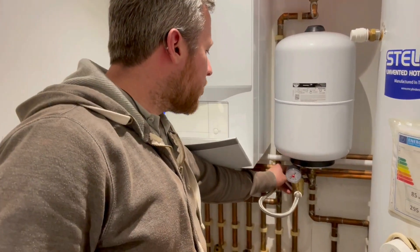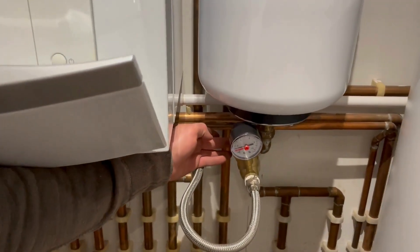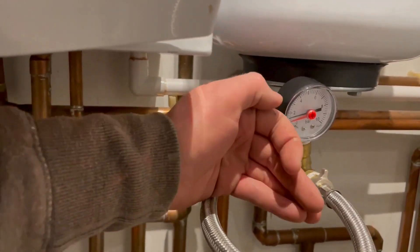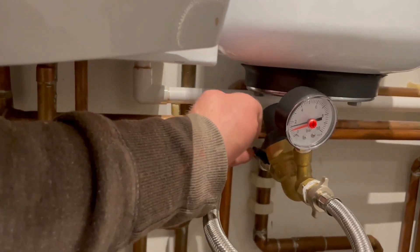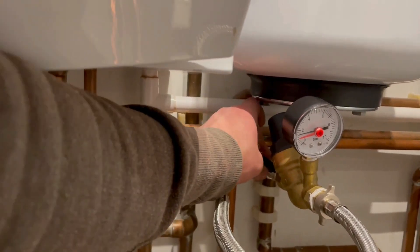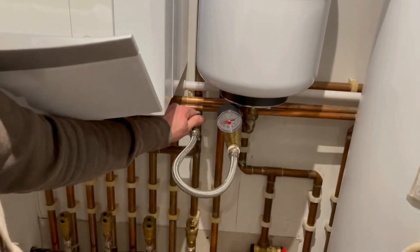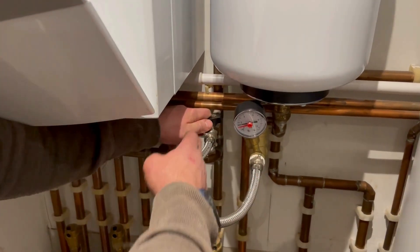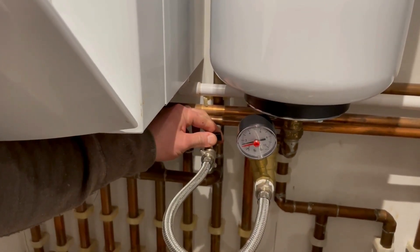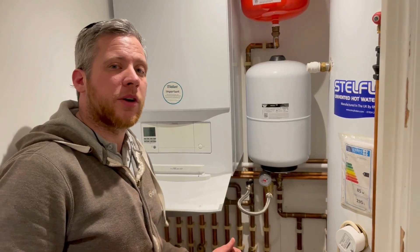First thing first, I'm going to turn on the cold water which is the water inlet — that's one valve on the flexi hose. Sometimes it's next to the flexi hose; in this case there's something called an auto filling valve, but we left the auto filling valve in for specific reasons, so we'll leave that filling valve open. That's the cold, and then we're slowly going to use the next one which will allow the water into the heating system. As I open it, water starts to go in, and at the same time I want to monitor the pressure as I fill it up.